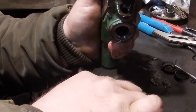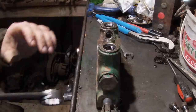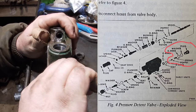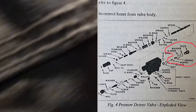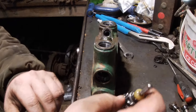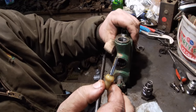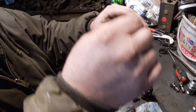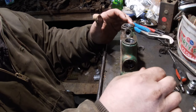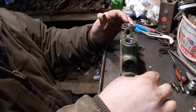This ball lives on top of that and goes up in here. Now we can start stripping down the rest — inside here should be a poppet and a spring. Here is your spring and poppet. All the poppet is is a valve that goes down in there and shuts off the oil so it doesn't come back through. If you raise up the implement and as soon as you let off the lever it falls back down, your poppet is probably bad.